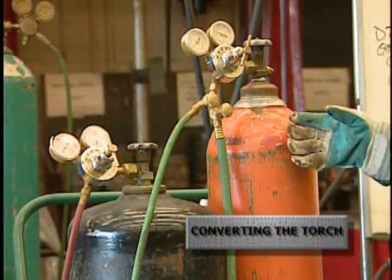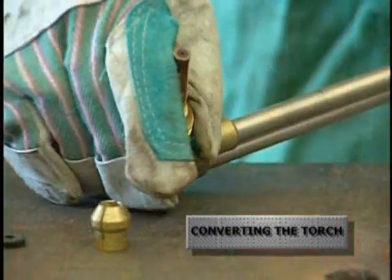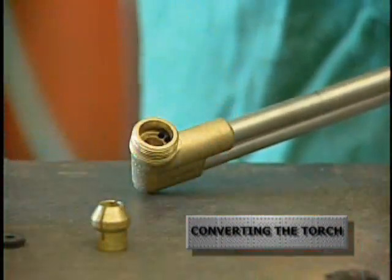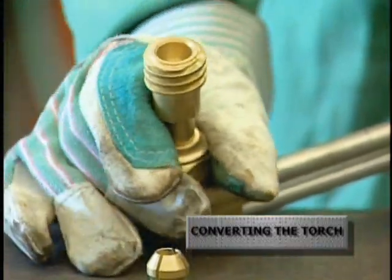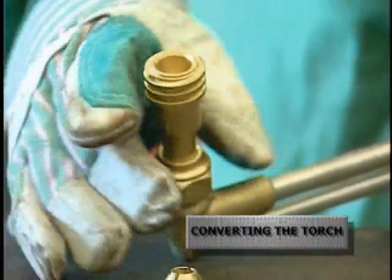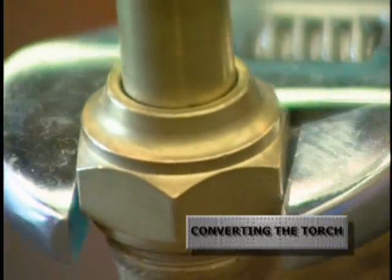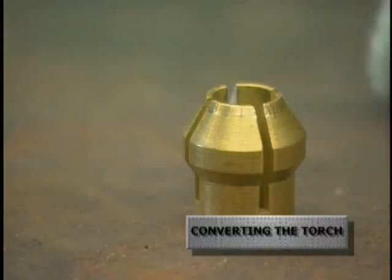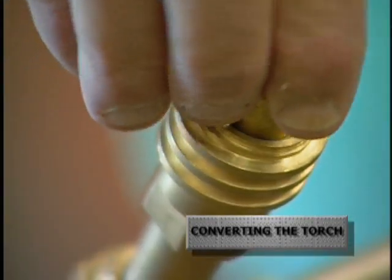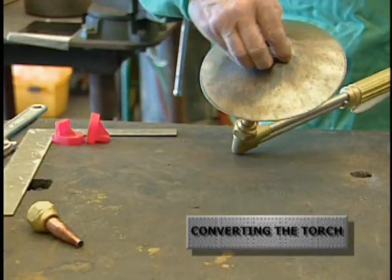Fuel gas and oxygen are the two gases needed for combustion in an oxygen fuel gas torch. Preheat oxygen and fuel gas pressurized through a cutting nozzle brings the surface of the material to be cut to kindling temperature. Adding cutting oxygen through an independent orifice in the nozzle effectively removes the desired material. The mini Caldo adapter was designed so it will never allow preheat oxygen and fuel gas to pass through the cutting nozzle. The cutting oxygen orifice is the only passage that exists. For added protection, a thermal arrestor is located in the head of every mini Caldo torch and adapter.